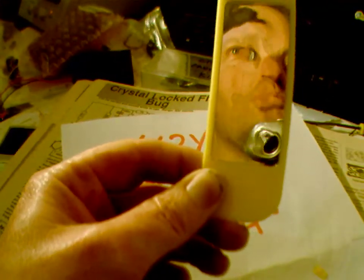Yeah, the 817, great general purpose rig. What was I going to say about it? The mic, yeah, definitely. The mic it comes with isn't so good. There's a thing you can buy, I think, from Germany, where you get a better mic that you plug in. I put in a different electret insert, and that made a huge difference. I did 1 or 2 videos from it, and people are always asking, 817, that's not the standard mic, is it? No. This is a lot punchier audio, and for QRP, punchy audio is really, really important.